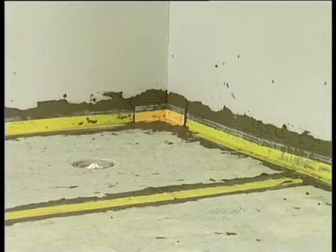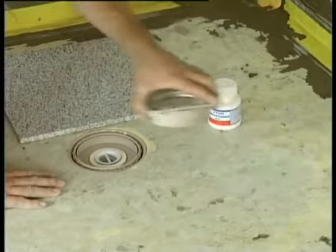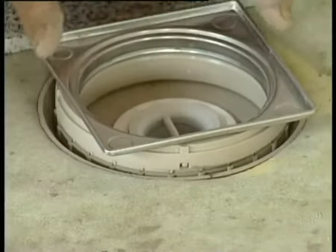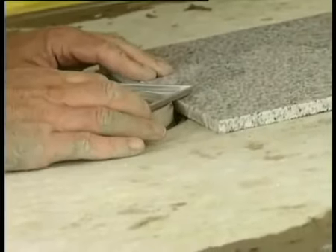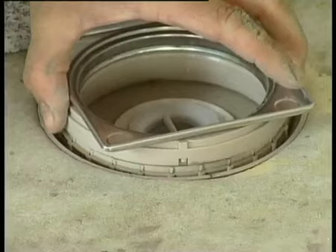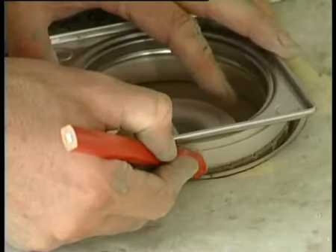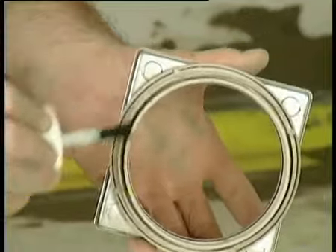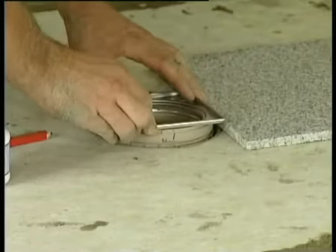You are now ready to finalise your tiled gully height. Replace the dip tube into the gully. Place the height adjustment ring in the locating position on the gully base plate — the ring will then rotate anti-clockwise on a rise-and-fall cam to locate the desired height. The lip of the stainless steel frame should sit flush with the tile to allow the maximum flow rate. Remember to allow for underfloor heating and an extra layer of tile adhesive. At this stage the grate will not line up with the direction of the tile; this can be altered once the cam has been fully secured in position. Mark the height position on the cam, then remove the ring. Apply a small amount of solvent cement onto the cam faces of the ring, return to the marked position, and allow the solvent to dry. Once the solvent is dry, the stainless steel frame should move independently of the ring to allow you to align the grate with your tiling pattern.